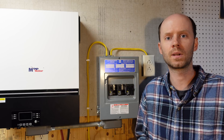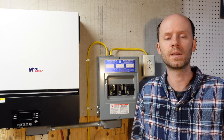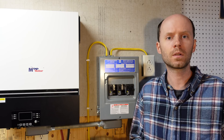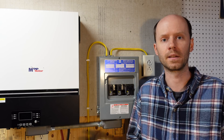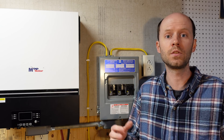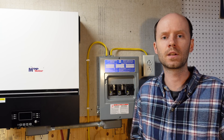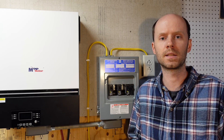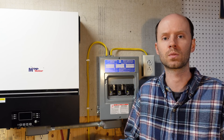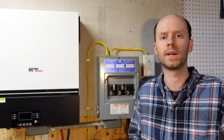In a typical residential electrical system you will have a ground-neutral bond, which is a jumper between the ground and the neutral, or it could be a single large bar in your service panel where the grounds and neutrals both land. This will typically be located in your main service panel, or in some newer or upgraded systems it could also be located in your meter box if you have one with a circuit breaker or disconnect built in. But for most of us it's probably going to be in the main service panel.